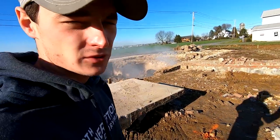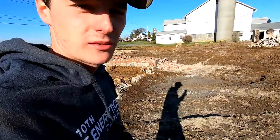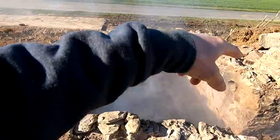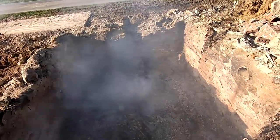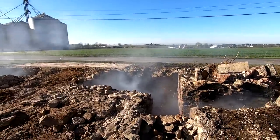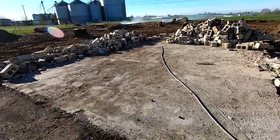It's going to be four bedrooms, two and a half bathrooms, with all the bedrooms upstairs. The builders really want to get moving to beat the winter — get the concrete in the ground and get it framed up and under roof as soon as possible. They're starting to dig out on Monday and I want the concrete poured by the end of the week. Looking at this old foundation, I'm pretty sure they built this section first and added the bigger basement later — must have been a lot of work, hand-dug and then laid with rock. This will all just be front yard. The driveway into the garage won't be right above the basement, so there won't be much settling. We'll have the excavator dig all these stumps out and figure out what to do with the old cistern — there's a pretty big hole in the ground there, so we should be able to fit a bunch of concrete underneath and put dirt on top.